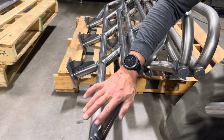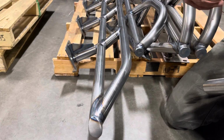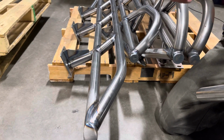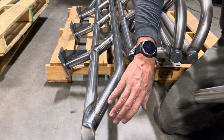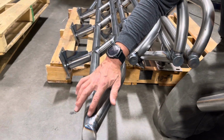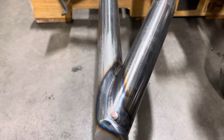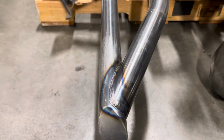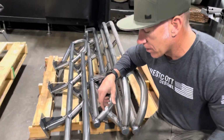On our TIG welds, we weld them not once, but twice, and that's just to make sure that it's that much stronger of a weld. On top of that weld, we want it to have a certain look, and that's why we try to, as you call it, stack dimes here. That's what we've done in this. We have some very talented people that work here. We're very lucky to have the skill sets that these guys have to offer for our rock sliders.